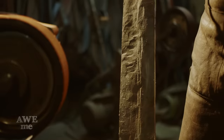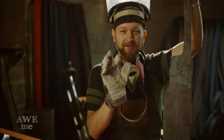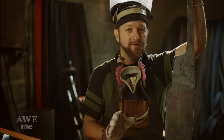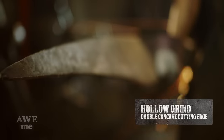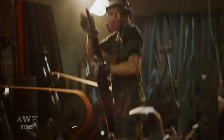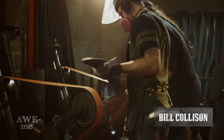We have our final shaping done on the profile of the blade — it's time to start edge grinding. In the game the edge has a really narrow plunge grind on it. We're gonna do a little more realistic edge on this great knife to give it a better chance to cut things well in the demo. So I'm gonna start on our 12 inch wheel and just do a hollow grind on the edge. I've tackled some pretty big blades on Man at Arms, but sometimes size really does matter, so I called in Bill to help me out. He's gonna hold one edge as I grind the other.